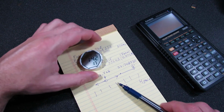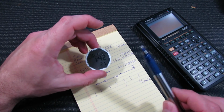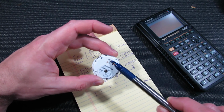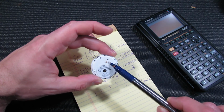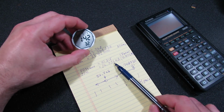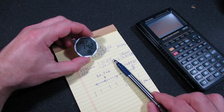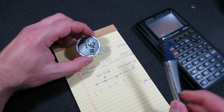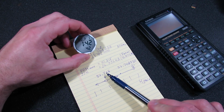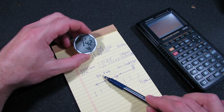And the next step, probably in the next video maybe, I want to try to swap the old crystal quartz for a brand new crystal quartz with 5 ppm accuracy and a low temperature drift, or low temperature coefficient. It depends on temperature; a crystal quartz can change the frequency to higher or to lower.